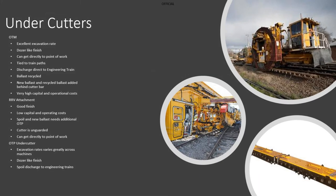The other system is the undercutter. The picture in the top right-hand corner — the Gopher — is actually a super RRV. There are a few undercutters existing, but a lot of them were built in the 60s and 70s. Some had refurbishments, but they're fundamentally quite old pieces of kit and in my opinion very, very underpowered for what we're trying to achieve, especially with heavier concrete layouts. They're slow.